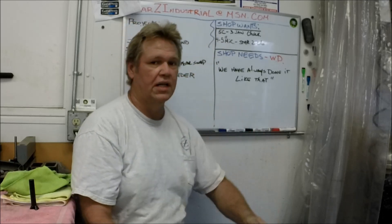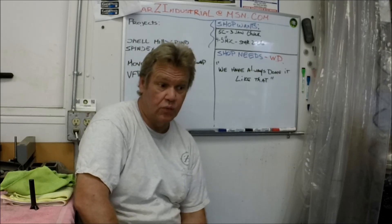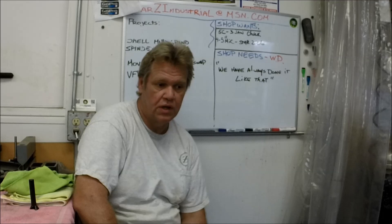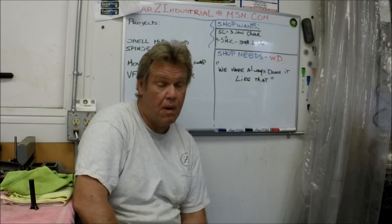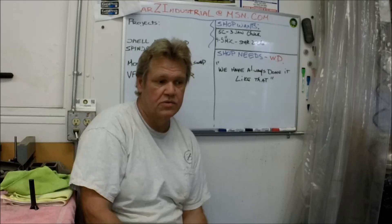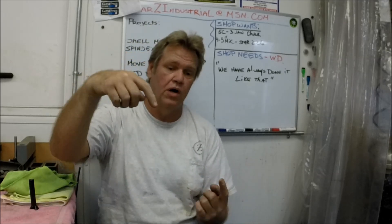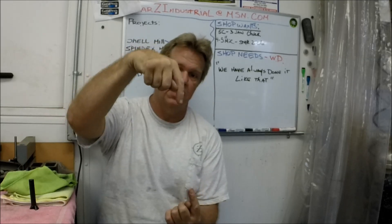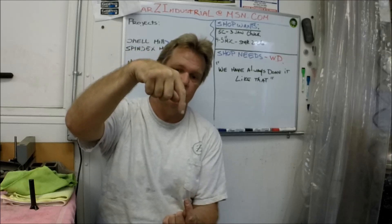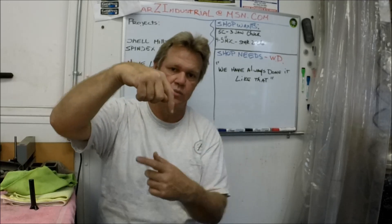You'll probably notice on the board it says 'We've always done it like that.' I ran into an older gentleman who actually works for another company but was assigned to me during the course of this job, and he was hooking up some airflow switches. I'm not going to call it the wrong way, but it certainly wasn't my way. He was running the air sensor tubing on some airflow switches, and typically what we don't want to do is — if you've got a blower, a fan, and a duct line, you've got a pressure sensor above and below. It senses vacuum on the low side and pressure on the high side. When you face them towards each other, the upper one sees a pulse of air because it's within a few inches of an actual propeller.